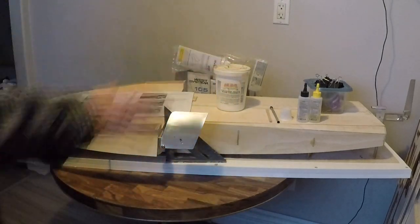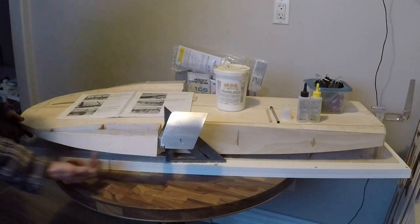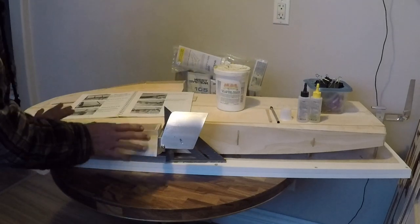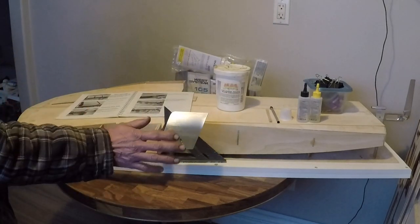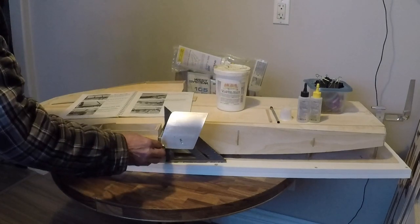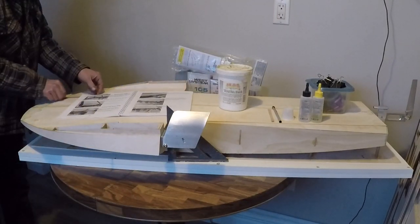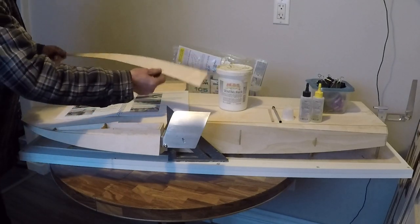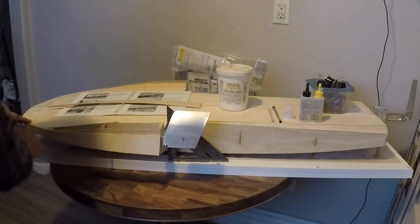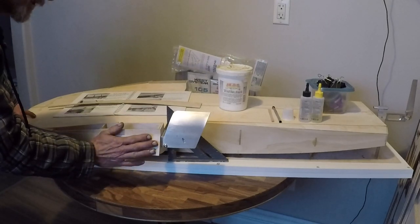I used a filler product with my epoxy and got a really good coat on the surface area — on the spray rail, on the outer chine, on the bottom. I put a good coat on the forward non-trip, put it in, and clamped it with 18 clamps, letting it cure again for a full 24-hour period. I was nervous it was going to pop back off, but it didn't. This time it adhered to the bow perfectly. So from here on out, when I install the second forward non-trip in front of you, you're going to see me mix some colloidal silica in with my epoxy so it sits on top of the surface rather than soaking in.